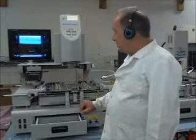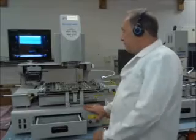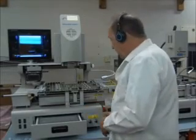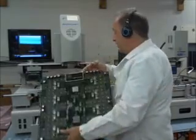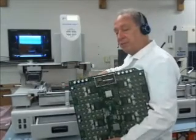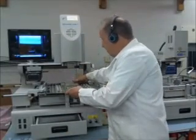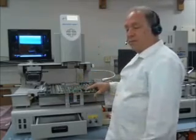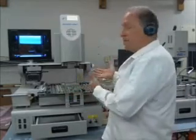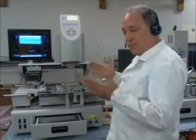So our installation went well — it went on nice and even. This machine is the SV560A. Something critical when you're doing boards this thick is that you have the area heaters that will heat up the boards. We were able to bring this board up in certain areas to a little over 100 degrees on the bottom side. Preheating the board with the area heaters is going to reduce warping — without these, the board is going to warp and bow a lot.